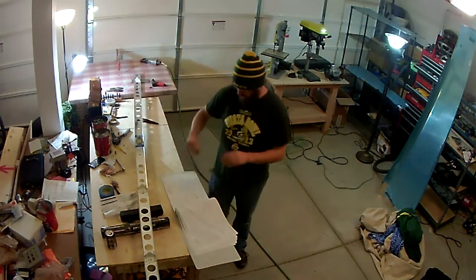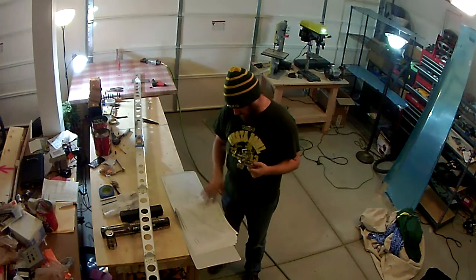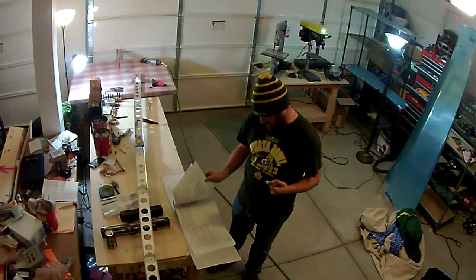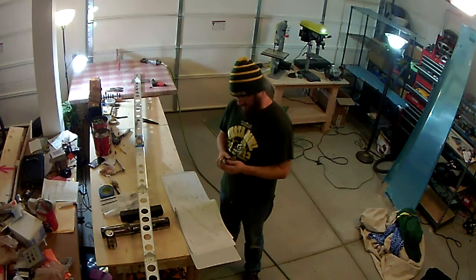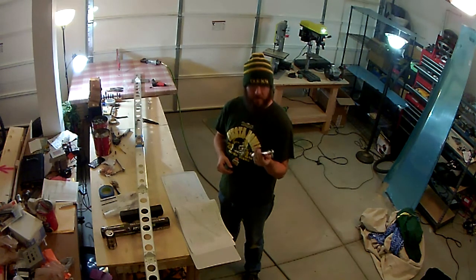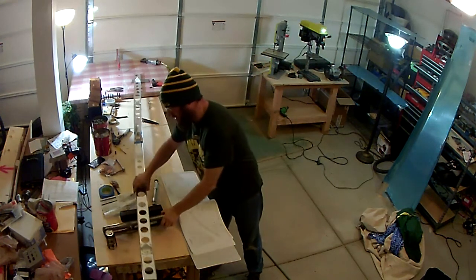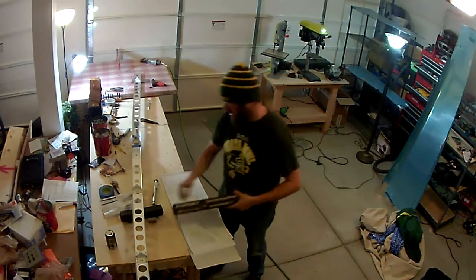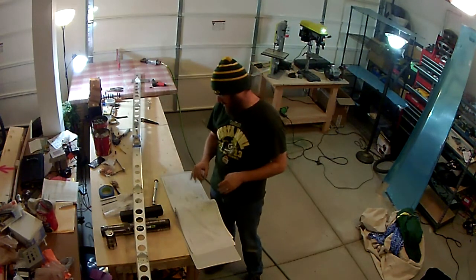The other thing: I went to a local tool shop and picked up a couple of torque wrenches. Section 5.2 has a list of various torque settings for different size nuts. I got two separate torque wrenches — one is a 20 to 200 inch pound wrench, and the other is a 20 to 150 inch pound wrench — which together cover the range of the various torque specs.